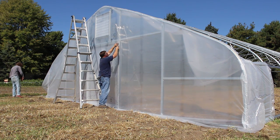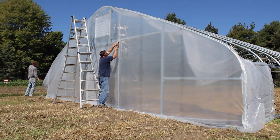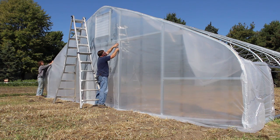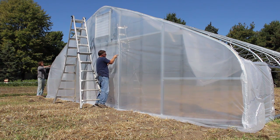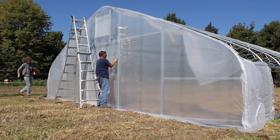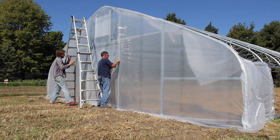After I have the end wall perimeter all secured, I like to start at the top of either side of your door, and I like to wiggle wire from the top downward. I like to do this because I think it creates really good tension from the peak down to the bottom where you have your initial temporary 5 to 7 inch piece of wire. And I'm going to work this wiggle wire all the way down toward the ground, on either side of the door.